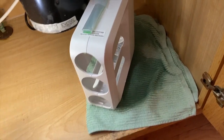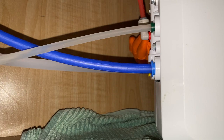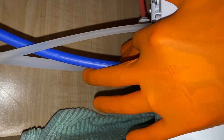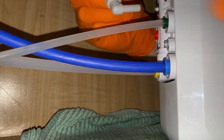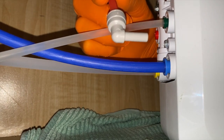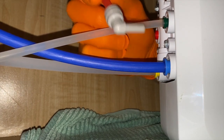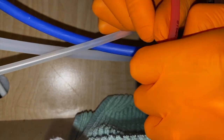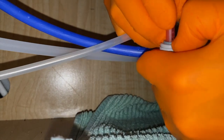Next, as you can see, the towel gets pretty wet. I'm coming to the back side and I'm going to carefully remove that flow restrictor. To the flow restrictor, I've got a flat head screwdriver. I'm going to carefully insert it and push that inner red connection in until I can pull that flow restrictor right out. These should come out in a very friendly manner. Do not use the screwdriver to demolish that red push fitting. I will push that upper gray push fitting down and simultaneously pull the red line up and out of the connection.